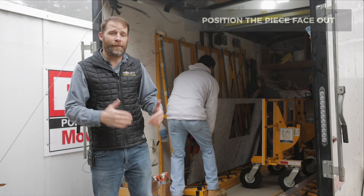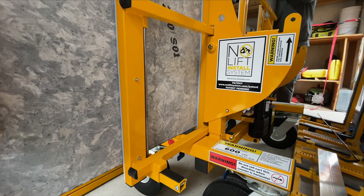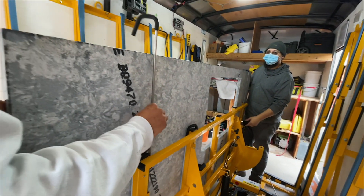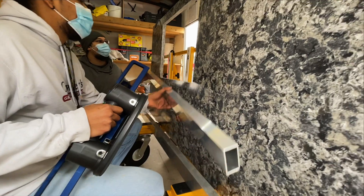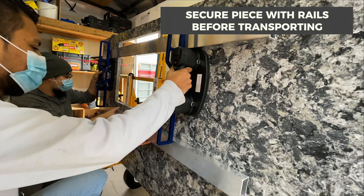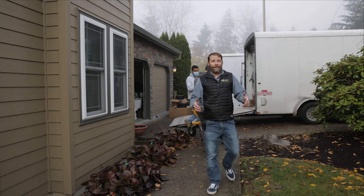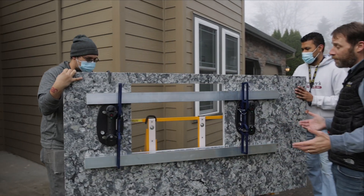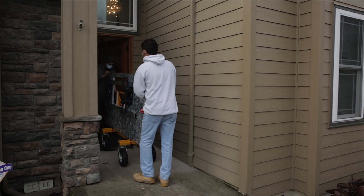We're first going to lift the countertop up onto the cart frame and then gently walk the piece down into the chocks where it's going to actually ride on the frame. Once the countertop is leaning up against the cart frame, we want to drop the hooks over the top edge of the countertop and firmly secure them with the T-handles. This is especially important with countertops that have cooktop cutouts or sink cutouts already in them — you must put the rail supports on the countertop before transporting the piece into the work area. It's important to have the hooks secured on the countertop because in situations where you have a threshold or a curb, it's nice to use the counter to maneuver the cart into the work area.